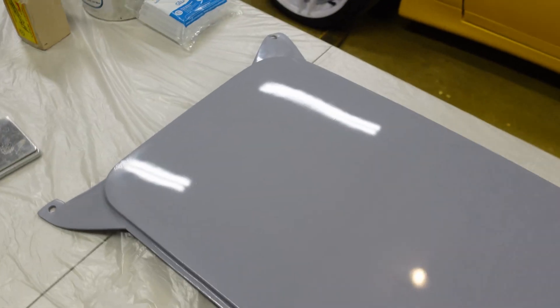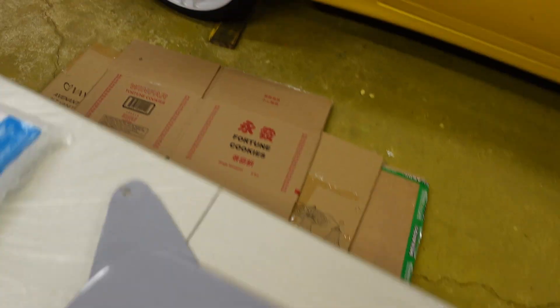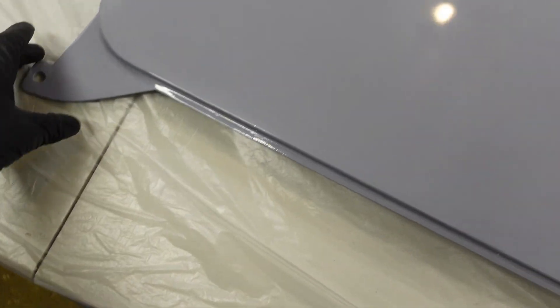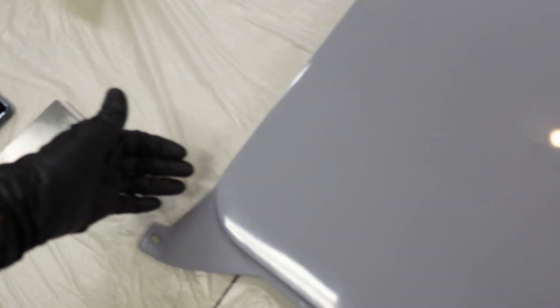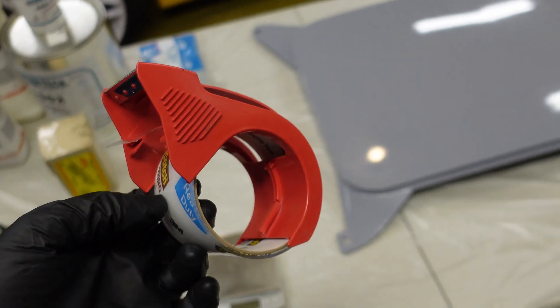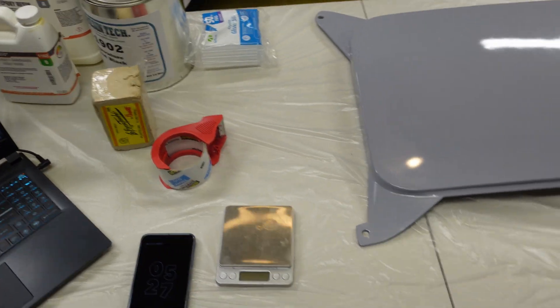The entire plug is prepped and ready to be made into a mold. The first thing I'm going to do is grab this cardboard and hot glue gun and make some flanges. The first side I'm going to do is the bottom — a nice big flat one here, a couple smaller flat ones on all of the legs, and some medium sized flat pieces here. Once the cardboard is all glued on I'm going to put packing tape on it, because nothing sticks to it even if you don't put mold release on it — it's pretty good for mold making.